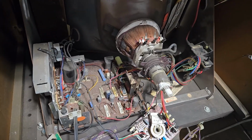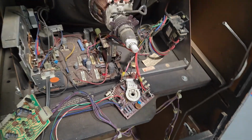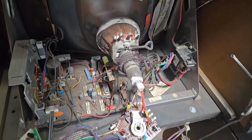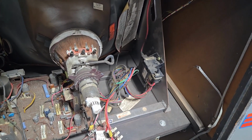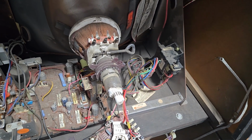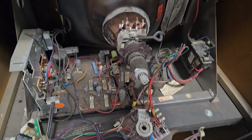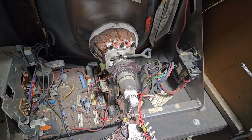But anyway, I'm going to put this back together, and I replaced the fuse at the bottom of the cabinet, because that one definitely did blow. And hopefully this thing is still alive. Worst case scenario, well, the yoke is still good. Yoke still tests good. Worst case scenario is that I fried a secondary on the flyback for the vertical amp voltages, 30 volts. If I did that, then this thing's kind of SOL. Hopefully I really didn't do that.